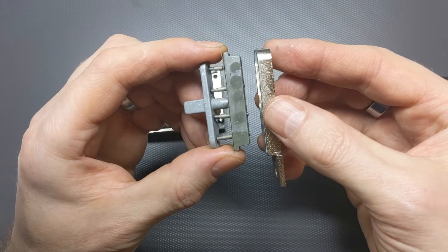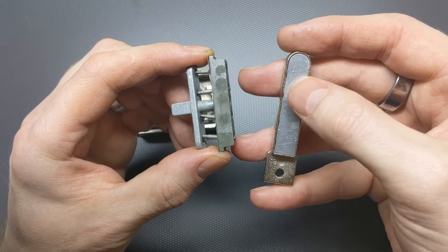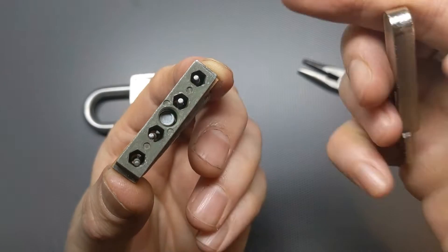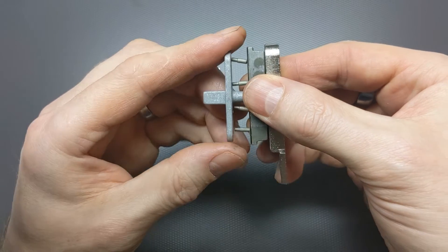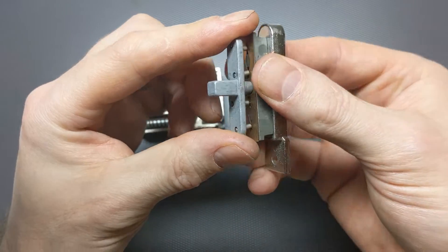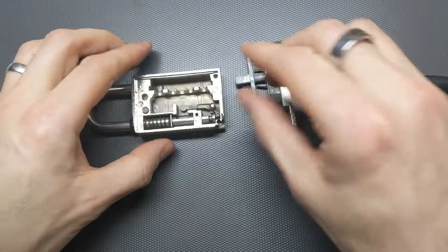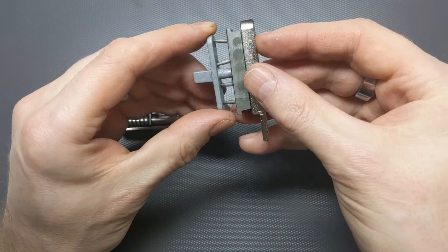Let's see what happens when I take the magnet and put it against those pins. They all move into slightly different positions. Inside this key there's a set of four magnets positioned in just the right places so that these pins — they're not magnets, but they're ferrous metal — get attracted by the little magnets in here to the appropriate end of the little hexagons. Just as happened when I used the pliers, the pins line up with the holes, they go into the holes, and the whole thing can move that way. Notice if I misalign the key slightly, it doesn't work — which is why on the padlock itself we have this key-shaped ridge, so the key goes into exactly the right position.